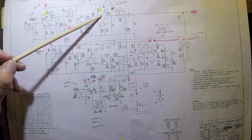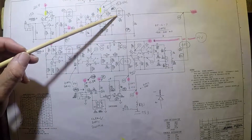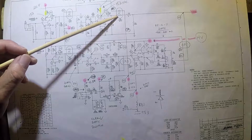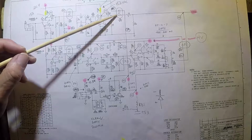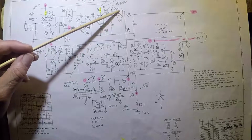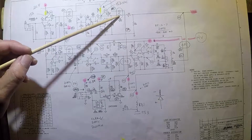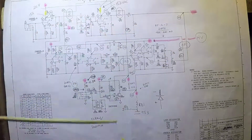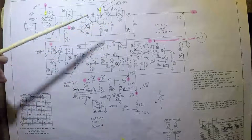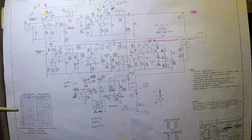And it comes out to the plate, and it goes through here. Here's the next coupling capacitor, and there you see the next resistor in the Opto-Coupler, OC2. So here's the LED. If that LED is off, the signal will be prevented from flowing out to the signal of the amplifier. So that is basically how these optocouplers work.